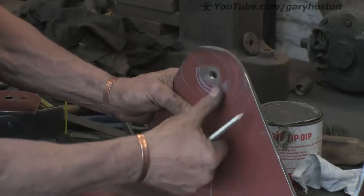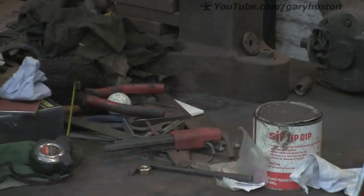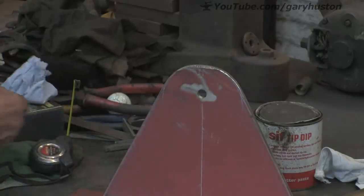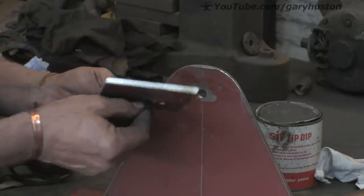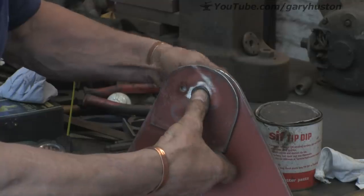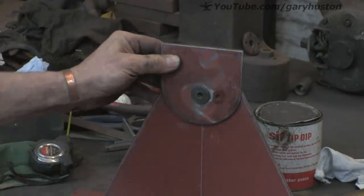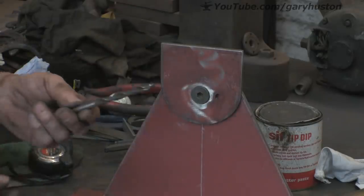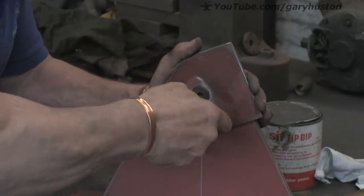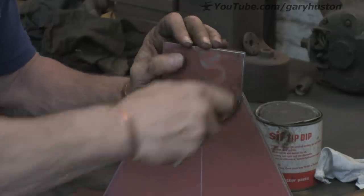No, I think I should be able to do it — it's only a quarter circle. If I drill lots of holes, I've got my die grinder, a bit of filing — it might not look pretty but it'll be just the job. So let's try it out on the second one, but this time I'm going to try and get the centre line so I know where I've got to put my centre dots to drill. What I'm going to do this time instead of putting a pencil through, I'm going to stick the 10mm tapping-size drill in that I've just used, and then hopefully the centre of that, if I move it and hold it in tight, it's going to scribe a nice little arc where I've got to put my centre dots.